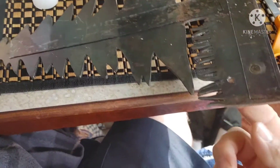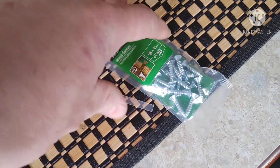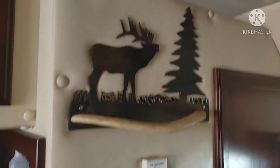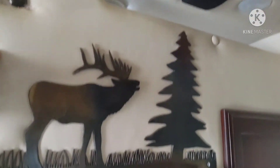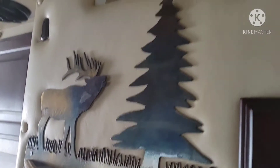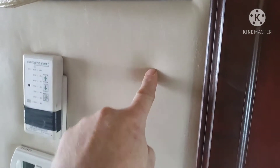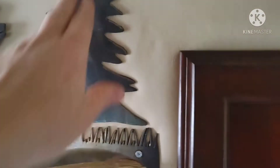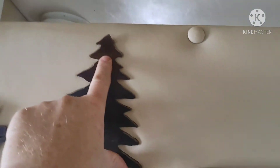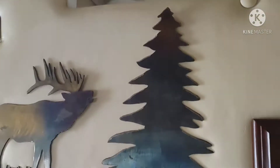I don't trust just two tiny little screw holes here because it's not going into real wood. I just used these little screws right here. I didn't sink it in far, but that's where it went. I think it looks absolutely awesome — our old holder just broke off the second you put any towels on it. I just got in like two or three threads because the walls behind it aren't very thick, so you don't want to put them too tight. But that two-sided tape is really going to hold it nice. I yanked on it pretty hard — it's in there good.